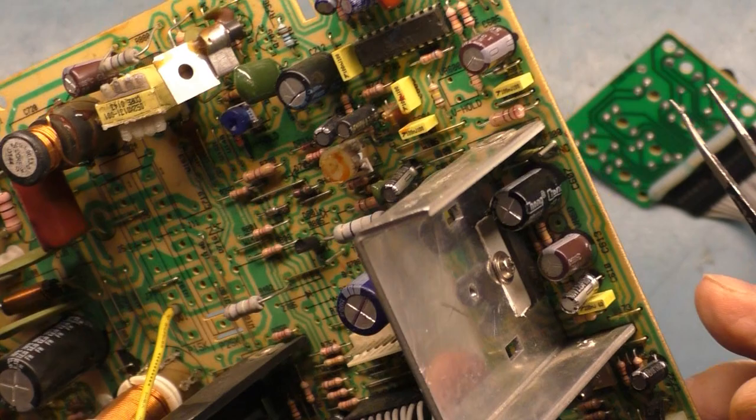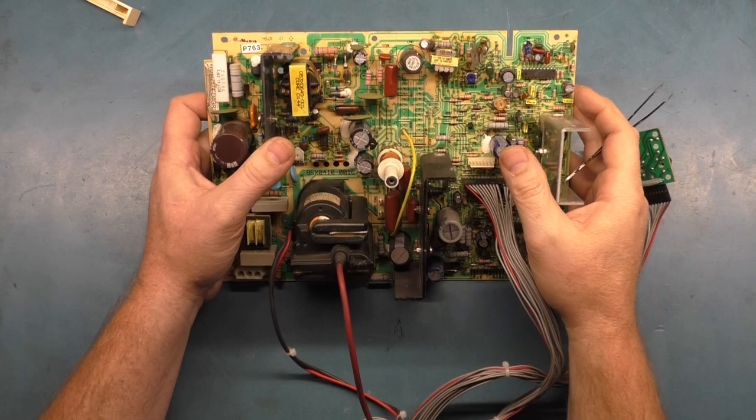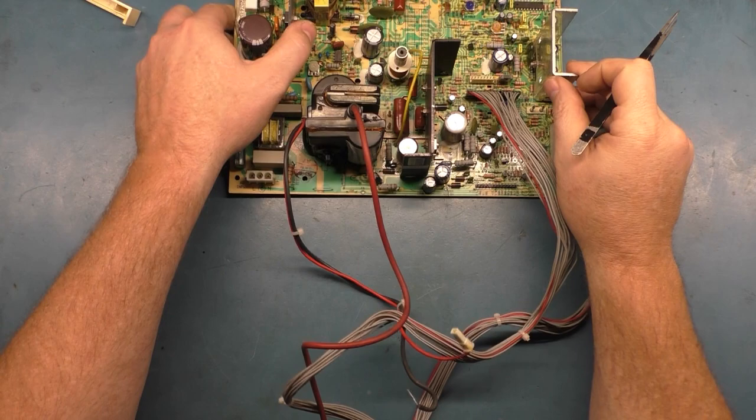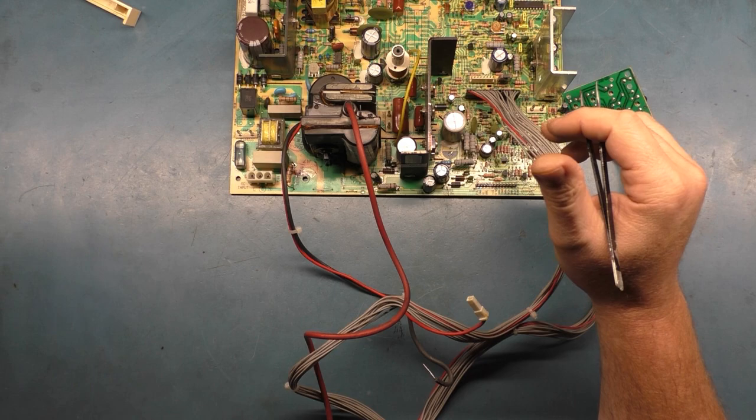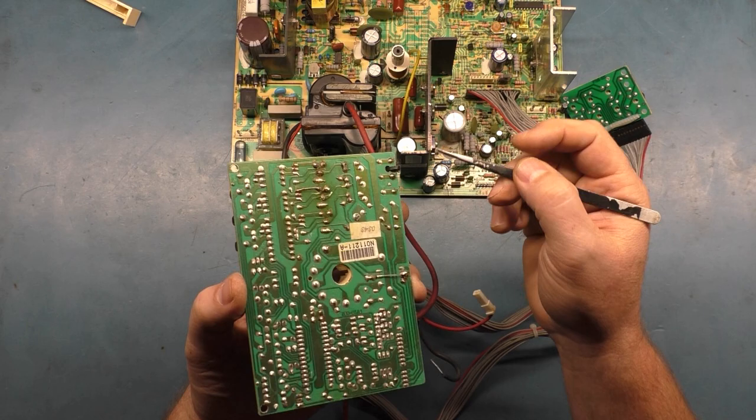Yeah, I'm going to just go ahead. The preliminary work for this to try and get this fixed is I'm just going to do a full cap kit and a full reflow and a little bit better inspection just to make sure nothing else is amiss. We know it's functional, so nothing is actually faulty. I just think we just need to do a cap kit and a reflow, and I'll very likely fix the problem. I need to do the rework on the neck board, get the pads fixed. Then we'll go over that when I get that done and reflow everything on here.